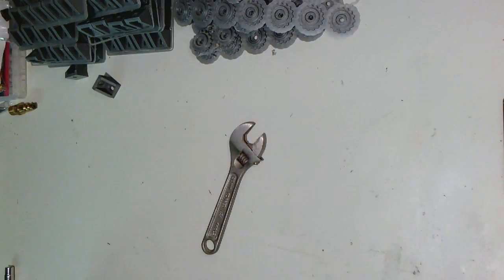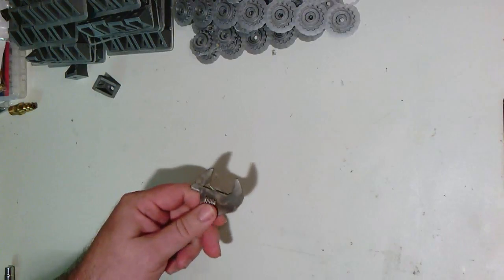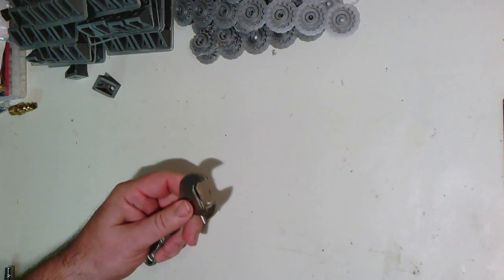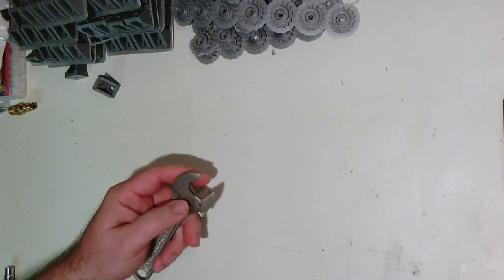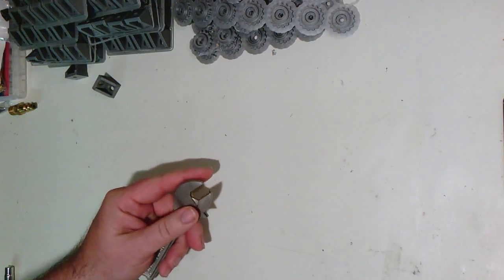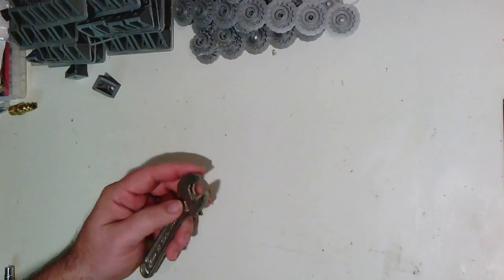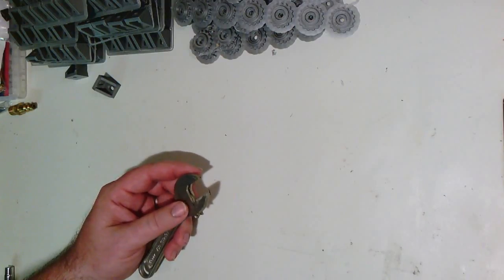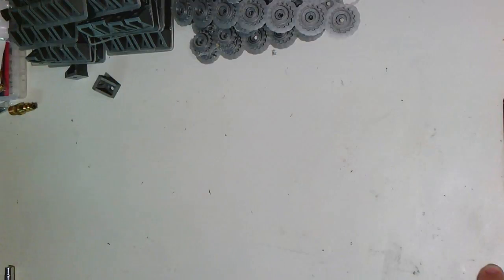Okay, we'll go down the list of some other things. My dad's crescent wrench you don't need. However, a crescent wrench like this will come in handy, and we're only going to use it for one or two items. There's something very hot called the hot end, the heat block on the hot end, that we're going to need to hold on to while we're doing some tightening while the thing is hot. And when I mean hot, it's going to be approximately 190 to 210 degrees Celsius. So it's going to be really, really hot, and you want to be able to hold on to that while you're tightening the last little bit. We're talking the very last little bit of the nut that is going to be your nozzle. And speaking of that, you'll need to get a very small set of, where did I have all these laid out nice and pretty.